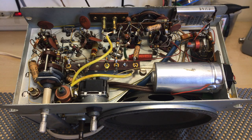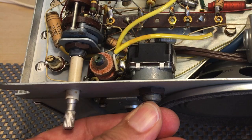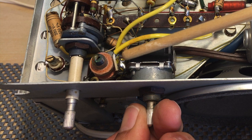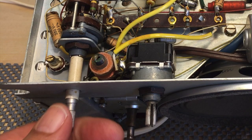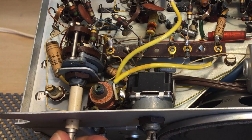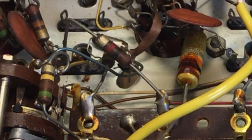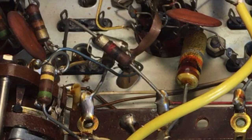There's our pot with a switch. It's pretty tight, so this thing needs some contact cleaning. There's one bright solder connection over there, which indicates somebody might have opened this. The switch, all the contacts are visible, so they should be able to allow for cleaning. Everything is geometrically wired here. I noticed that the resistors are actually bent at certain right angles to get them to fit perfectly.